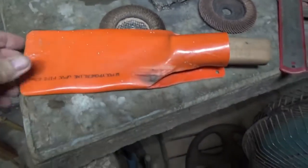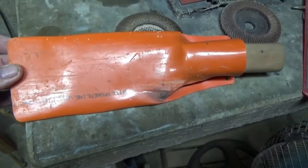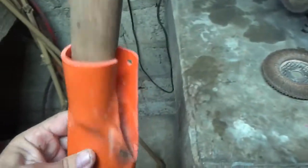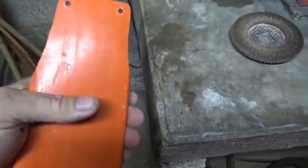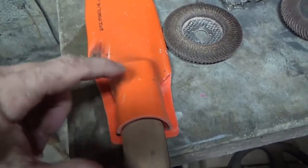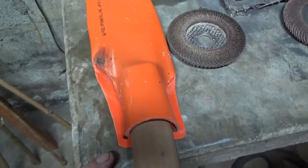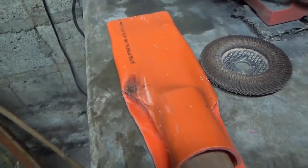So this is what I wound up with here. I took a piece of something close to three inch — 63mm UPVC, whatever that is. Real thin walled — this is like a conduit or a drain pipe. This is the best sheath that I've made so far. I used a Dremel tool with a cutting wheel on it to make a couple cuts on it. I put the blade in there and squashed it down, and then couldn't get the blade out because the handle is this thick and the blade was catching on here. So I had to cut that out.